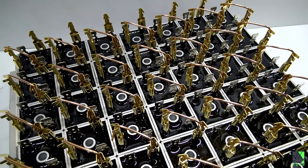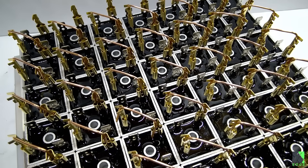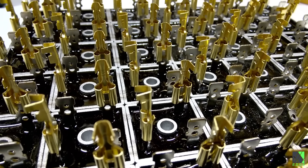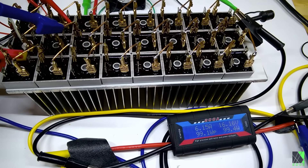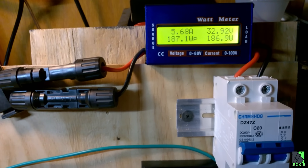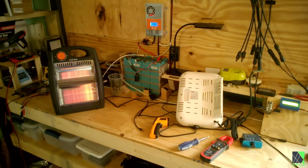Of course, I can also just use diodes by themselves, but pushing kilowatts of heat through diodes requires bigger heat sinks and other considerations. I'm working on those projects, but it will take time. I will probably never completely abandon solar electric resistance-based heaters, and will mostly use diodes to optimize heat production for my solar panels and existing space heaters.